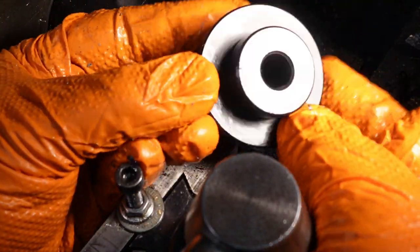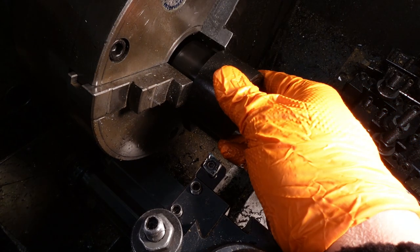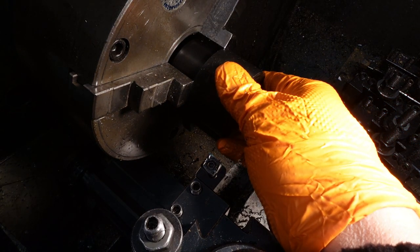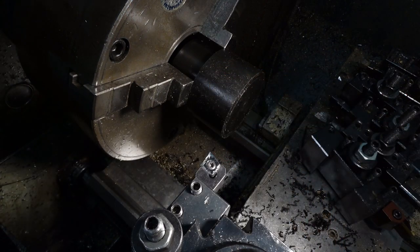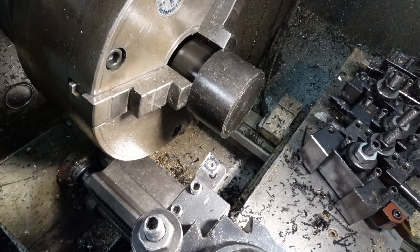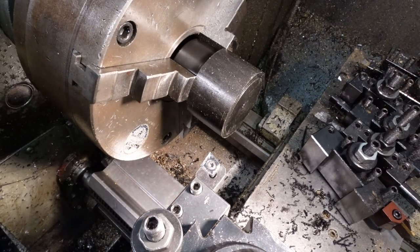Another part I've made right — amazing! I've got a short piece of this material left, so I'll turn a section to 50mm, sufficient to make one more part. I've chucked it up the other way round and I'll cut another part out of what's left, leaving it with maybe 10mm or so waste, which I'll turn into a disc for something or other.